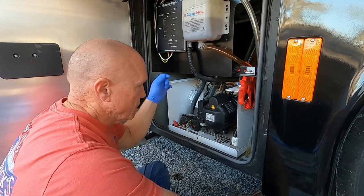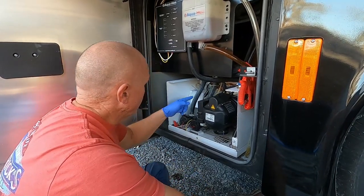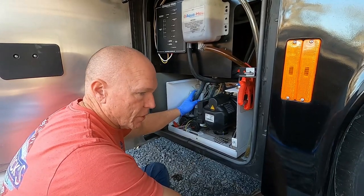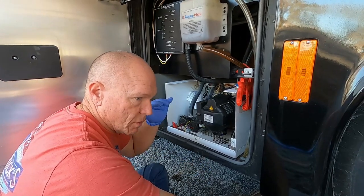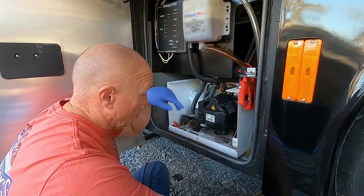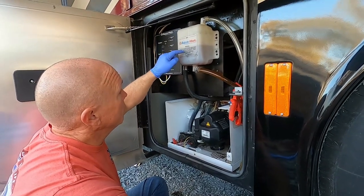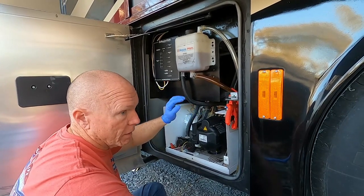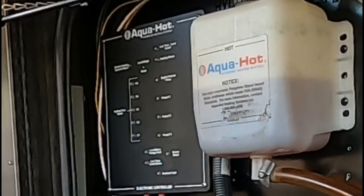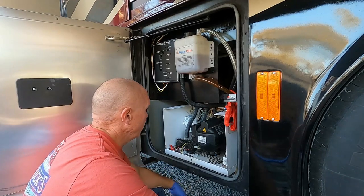You set it at 74 degrees — if it drops to 72, it kicks on, just like a regular thermostat at home. There was a click just now — that was the electric element turning off. It was heating the tank back up because it had dropped below its cooler level. The boiler fluid gauge is halfway between cold and hot, which means the tank is hot. When completely off, the fluid sits way down at the cold level; when burning and running up to temperature, it moves way up.